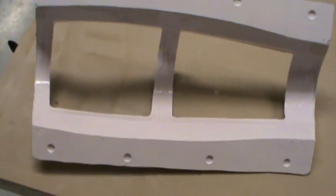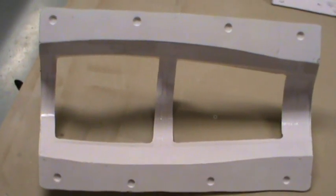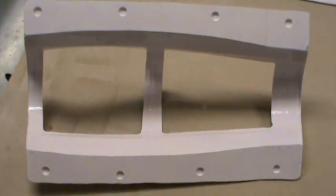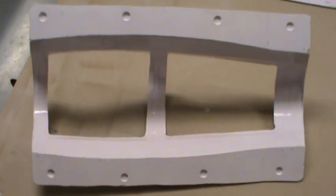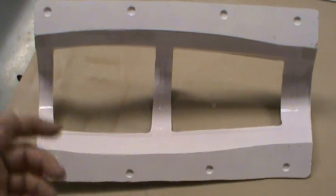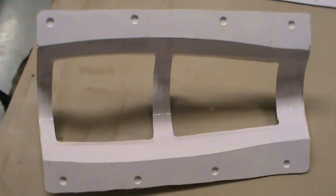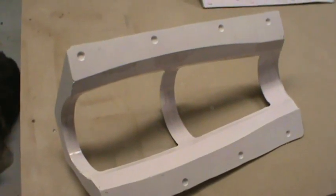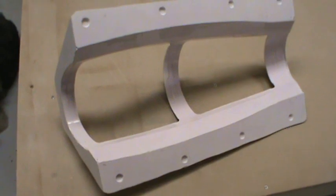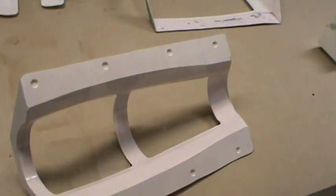I'm not going to vacuum bag this stuff. I'm just going to do hand layups, peel ply it, peel the peel ply off, assemble the halves. I mean, if I can do a 3.5 ounce layup by hand for the part, that's fine, and all the detail transferred over to it. So unless I end up putting some sort of Kevlar or a lot of carbon cloth into the layup, it'll just be hand layups. So this stuff's actually PVA'd right now. I'm gonna lay up another one.